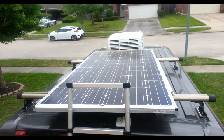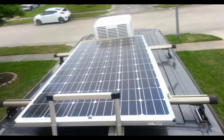It may seem I'm promoting the Sun World panels — this is the panel I have on my RV. It has outperformed itself, so I would recommend it. We will take a look at two other panels later in the video. A solar panel is connected just like a battery — it has a positive connector and a negative connector. They can be configured in series called a string, and the strings can be configured in parallel, just like a battery.